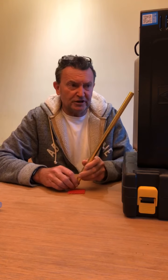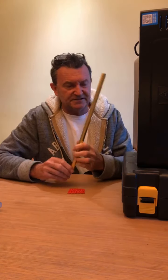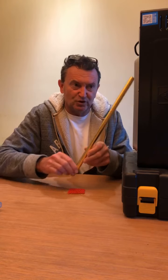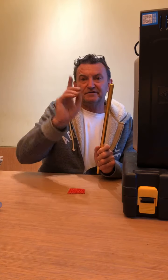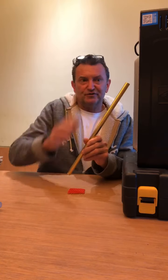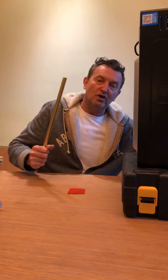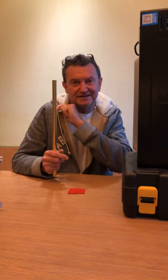Okay, so if we're going like this, where we're on 2 and 3 story, maybe even 4 story, with big arms, big shoulders, and you're just scrubbing away like this, then the force that we're applying is more in line with the pole, right? Because our brain will tell us to do that. But because you're pushing it up, part of that force is being applied in the vertical. Force is broken down into vectors, and you're looking at the X and Y percentage of that based on the angle. So part of the force when your worker is pushing the pole up and down is applied to the vertical, which is why the brush goes up, and part of the force is being applied against the glass, opposing the natural force coming from the building, adding those two together, compressing the brush, increasing agitation.